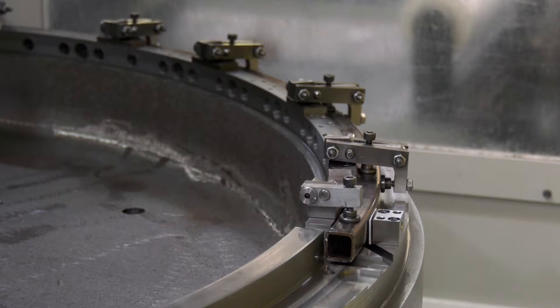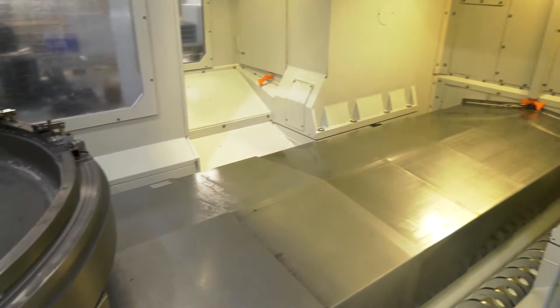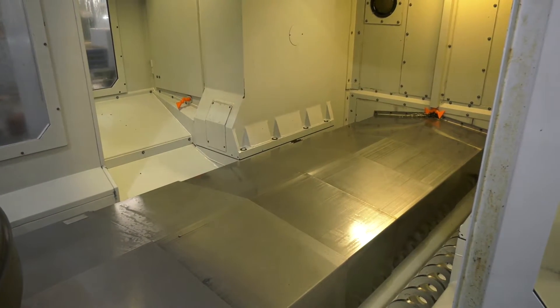When you were looking to purchase a particular machine to manufacture the engine rings, what were your considerations and why did you choose this particular model? The primary concern was first of all accuracy, but also the uniqueness of the layout of the machine. The kinematics of the machine are in such a way that it allows you access to various parts of the component that a lot of other machines wouldn't actually allow us to get to.